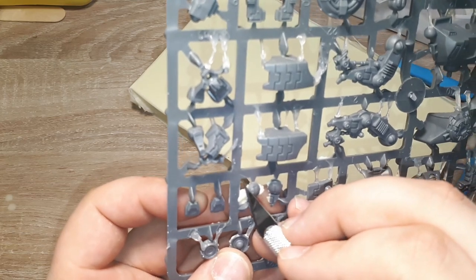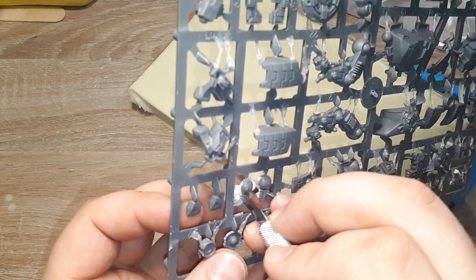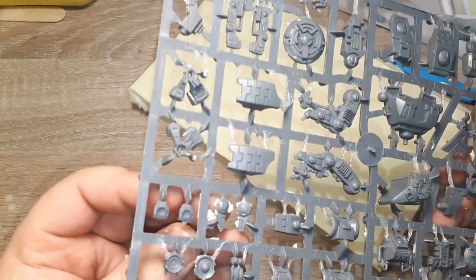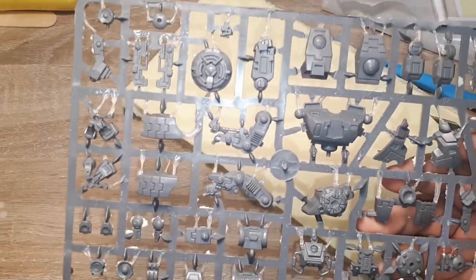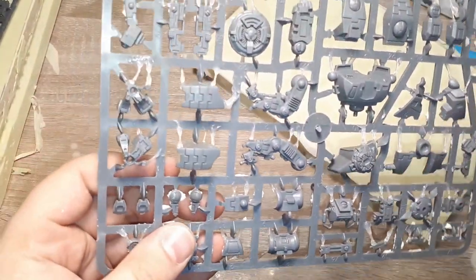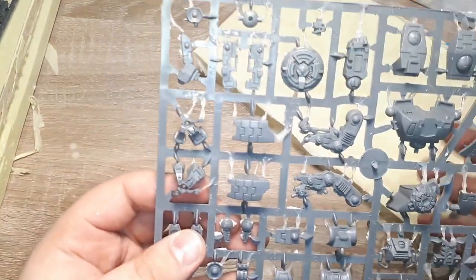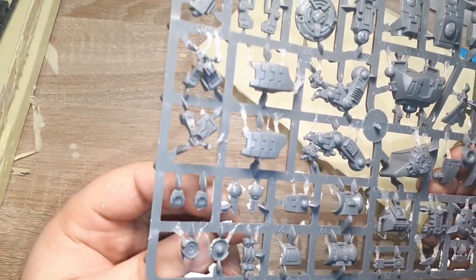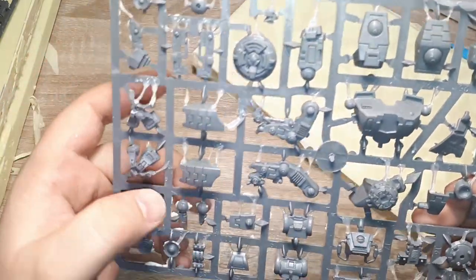This large chunk of bonded silicone was honestly pretty disappointing to see. And this is pretty much due to the fact that I've already used this particular sprue to create another mold test, and I never used the mold release spray, knowing that in the past I have managed to create silicone molds without the silicone bonding to the plastic. But clearly, that seems not to be the case.